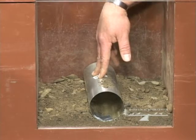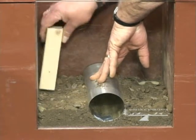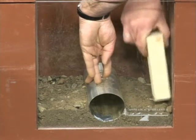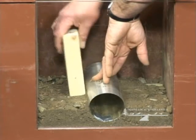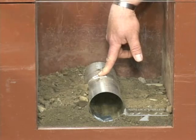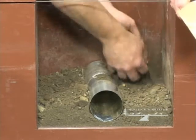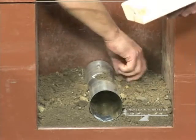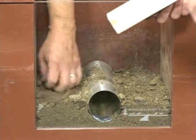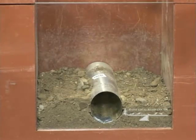It's pretty bony material here - I'll pound some sand so to speak. This could be as simple as a little hand tamper, let alone a mechanical one - that imitates the whacker. One could say we don't have a whacker available or we don't have money to rent a mechanical one. Well, you can see shortly what the impact of that's going to be. You could pretty much fabricate a hand whacker - just a metal plate - that would do the job. And of course in the future if you do a lot of these, it might be good to at least rent a mechanical whacker once in a while.